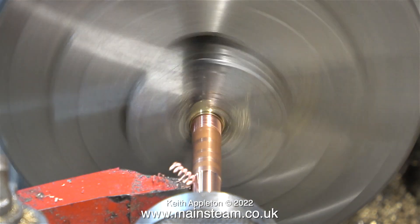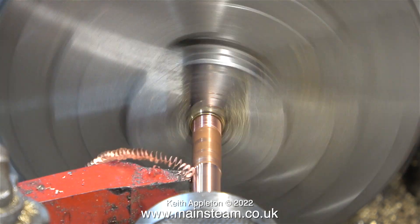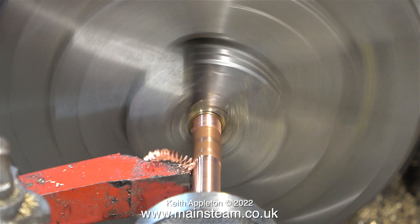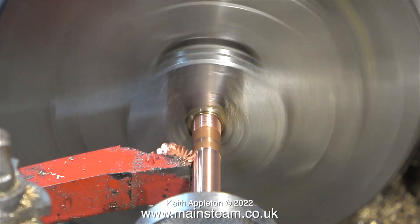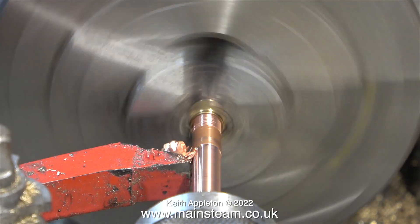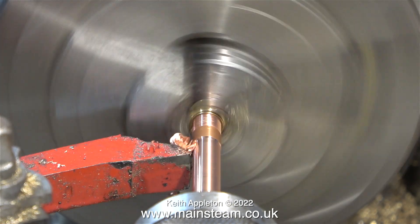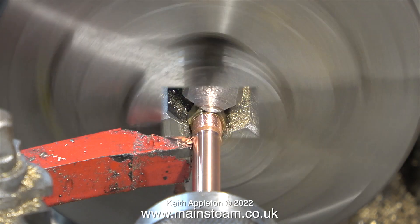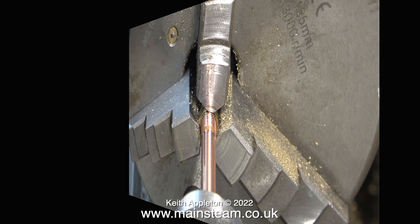In this clip I'm using a round nose tool to reduce the diameter of the copper tube. I am aware that later on in this video I'm going to run into problems because the hole in the bush of the boiler and the hole in the check valve don't really line up as well as they should. I had to make a slight modification to the check valve to make everything fit together, but in the end it did fit as you will see if you continue watching. The injector currently fitted to the engine is one I bought from the very talented John Holroyd at the Steam Workshop. It's very scale and looks great, but I'm going to have to modify the piping to make it work. Fitting the long piece of 3/8 of an inch diameter pipe from the check valve on the boiler underneath the engine to the other side where the injector is will not be an easy job because I'm doing it single-handed. I really need another person at the other side but it's very difficult in this small village to find anybody. This clip is showing the reduced diameter of the piece of pipe that's going to go down into the boiler.